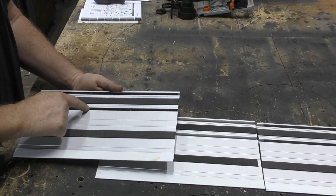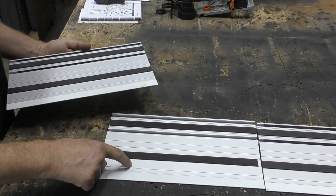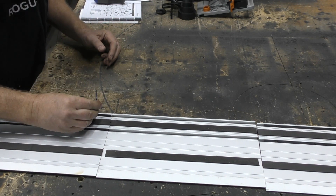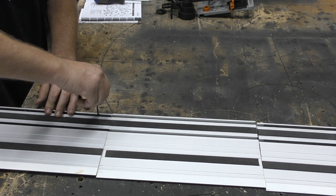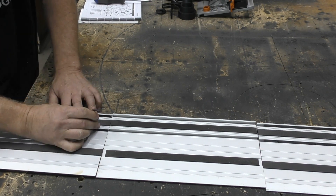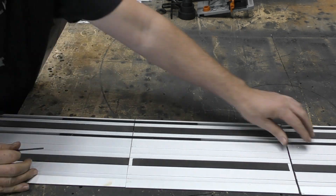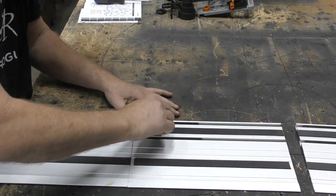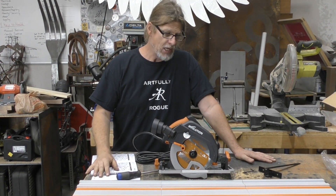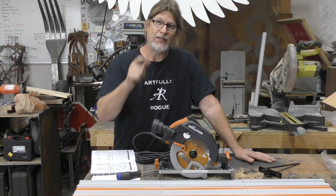In order to put the track together, you have to take the track connecting bars that are in two of the pieces of track and make sure that they run into the middle. Line them up, take the provided Allen key, and loosen those up a little bit so they'll slide easily. Okay, saw's put together, track's put together. I still have to get some track clamps, but I'm going to take probably three or four weeks to put this thing through the paces. I'll see you in about three or four weeks.